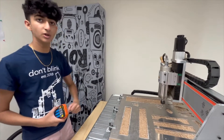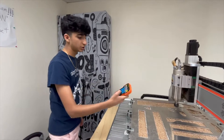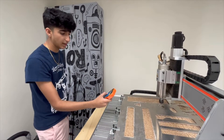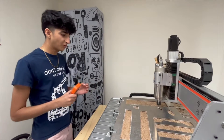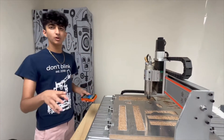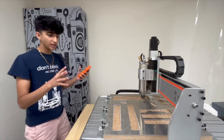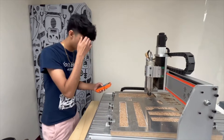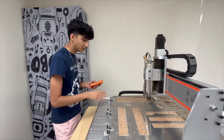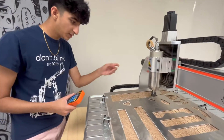We're using an Ohmio X8 CNC, and in my hand is the little controller we use to move the individual axes. Y-minus moves it in Y, Z-minus moves our spindle and bit down, and X-minus moves it in the X direction. Now let's get to zeroing our axes, starting with X and Y. As you may remember, when we clicked the model box point in our G-code, it orients that piece on the bed — we clicked it in the top left, which means on this bed it's also going to be positioned top-left.